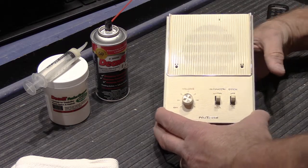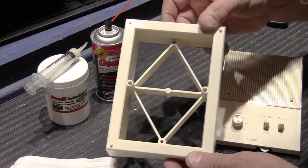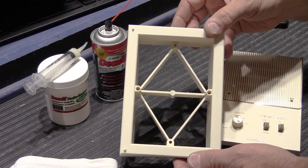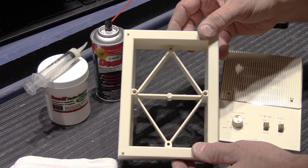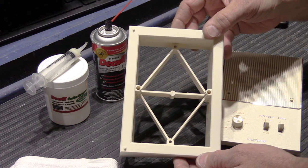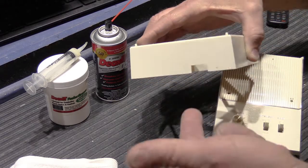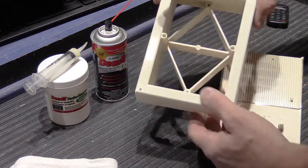Here's our 472B and this one is a two-piece arrangement. It includes the surface mounting base that would be attached to the surface of a finished wall, and then the speaker mounts on top of it. This would be used for a surface mount installation as opposed to using a standard wall housing or rough-in, which would give you a flush mount application. There's a notch in the bottom where the surface mount wire would be run into the base and hooked up to the speaker.